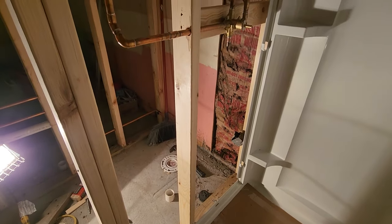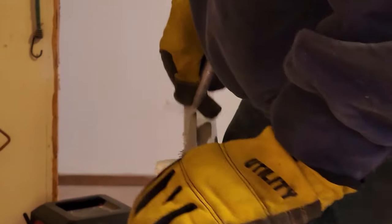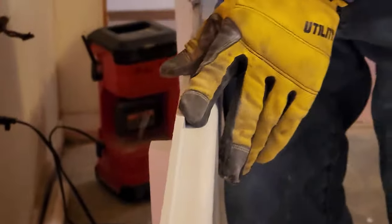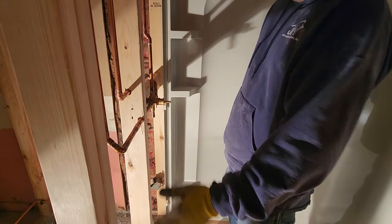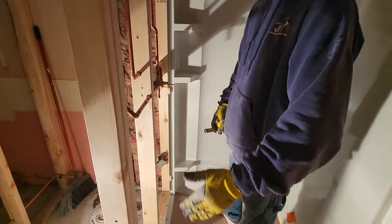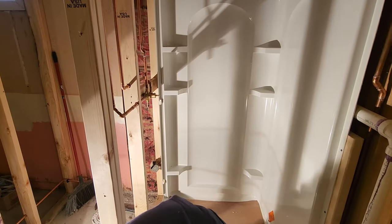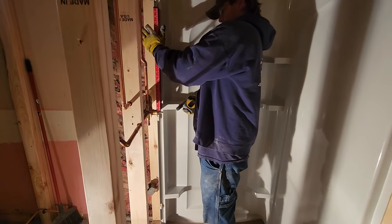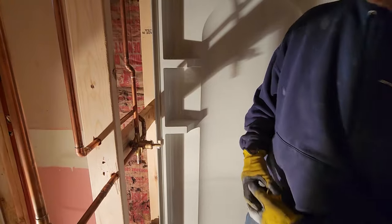We've got the back wall in and the right wall in. Now we've got to put the left wall in — this is the one with the shower valve installed, so at some point we'll have to drill a hole in the wall because the shower valve will stick into it. Here's how to measure: when you drill this hole in that left wall, you've got to be right on. Measure off of the seam of the back wall — about 10 inches over to center. Measure two, three times, drill once.